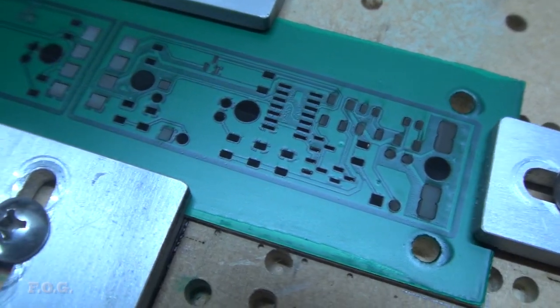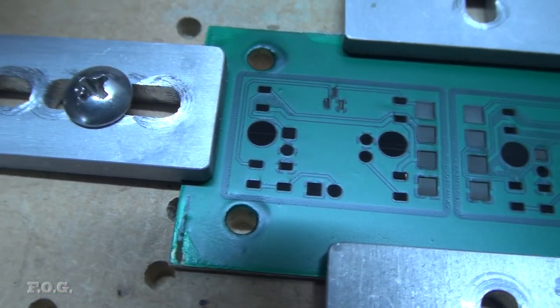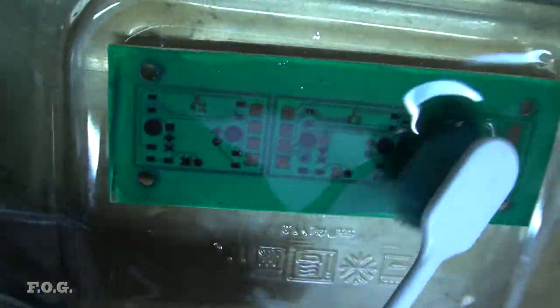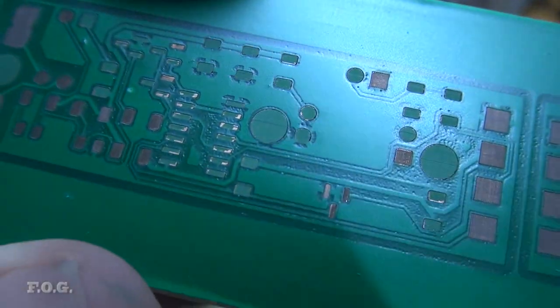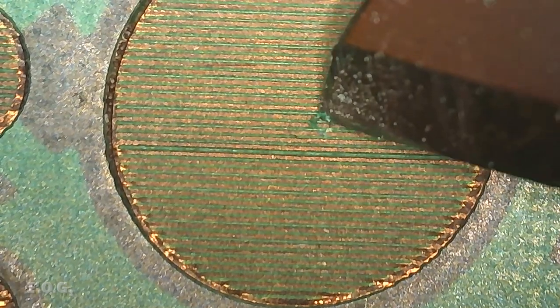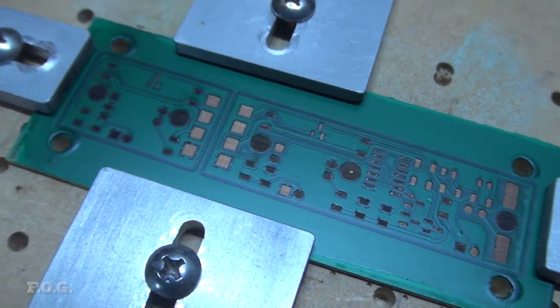I also came up with another plan for clearing the resin from the pads. This time I slowed down the feed speed and also dropped the power levels. It's a little bit counterintuitive, but my idea is that slowing things down a bit will give the pads more time to dissipate the heat applied, and hopefully I will also get a wider burn path. After the first burn and clean, it looks pretty good, with just a nice thin and even resin coat remaining. A second run with the same setting seems to remove most of the remaining resin.